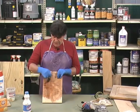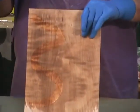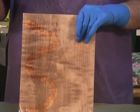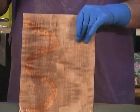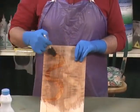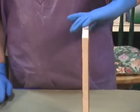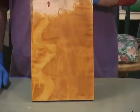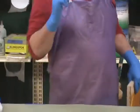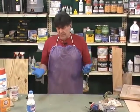But you can actually watch what it does to a dye. Now I'm going to emphasize to you, it does not work on stains. Stains are heavy pigments, okay? It can help on a water-based stain, but it don't touch oil-based. See it happening? Just that quick. Now this is a water-based dye. This is one application. I may need two. On the back is two applications on a water-based dye. Pretty dramatic, huh? It'll flat knock the color down. Now it does not remove the dye. Just like it does to your clothing, it neutralizes the color.